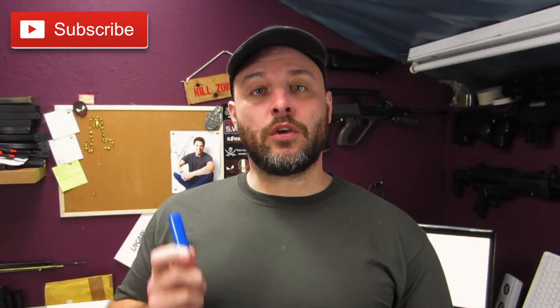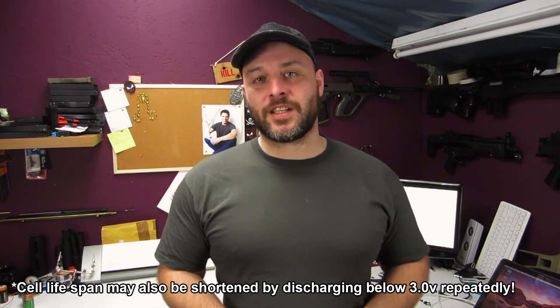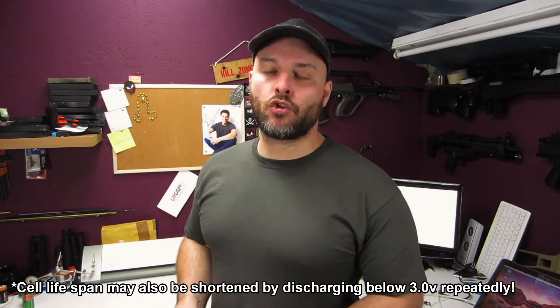That's quite good. They have the exact capacity that the manufacturer claims, over the voltage range that they claim. All four batteries gave 2200mAh between 4.2V and 3V. You can see that with 18650 cells, there isn't much benefit going below 3V, because you don't get much capacity return for that extra half-volt drop. But I wanted to test them on the same range I've used for previous batteries.